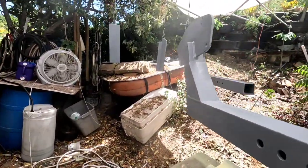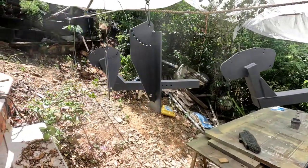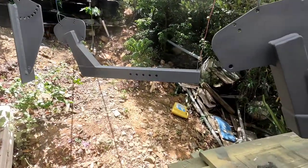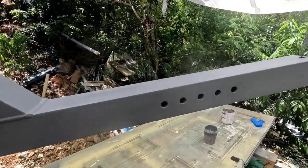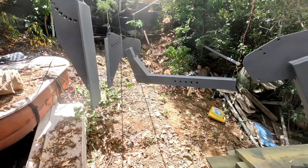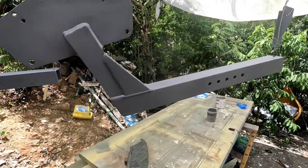So we've got 2 coats of Max Core anti-corrosive primer followed by 2 coats of 545 gray primer, which is also anti-corrosive. So this aluminum surface is well protected. Now we just have to sand it, a light sand, probably just 320 grit sandpaper, and shoot probably 3 coats of Awlgrip top coat. Stay tuned for the progress.